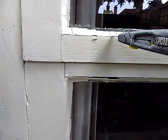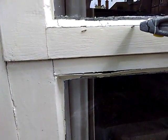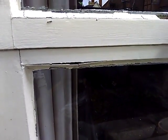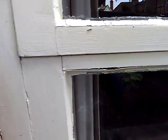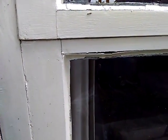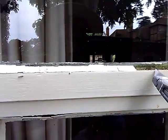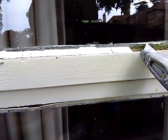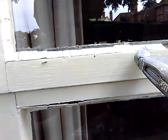I just take my Stanley blade — you can see when you have cracks you've got problems. I'll use a hammer and a chisel to get that stuff out because it's hard to do otherwise. If you get a chance to make a straight run it's easier than trying to fill in just a little piece — it's easier to do the whole thing. Because inside you can see the caulking is raised in there, so you want those to be the same height.